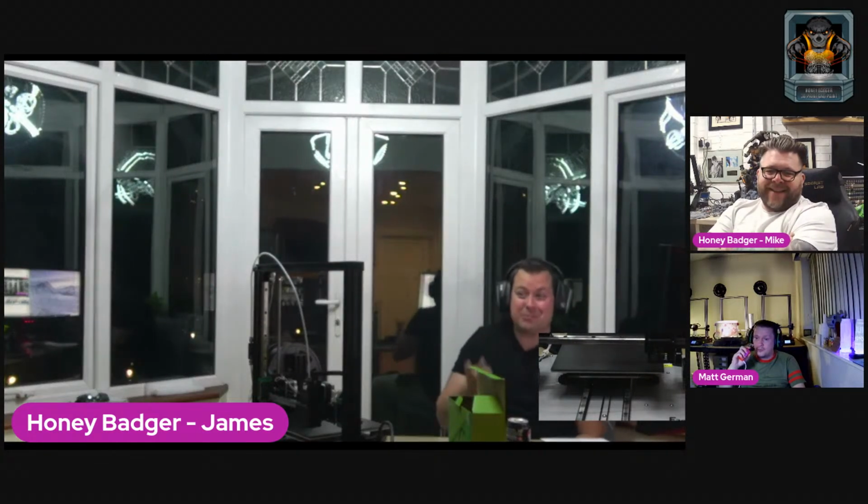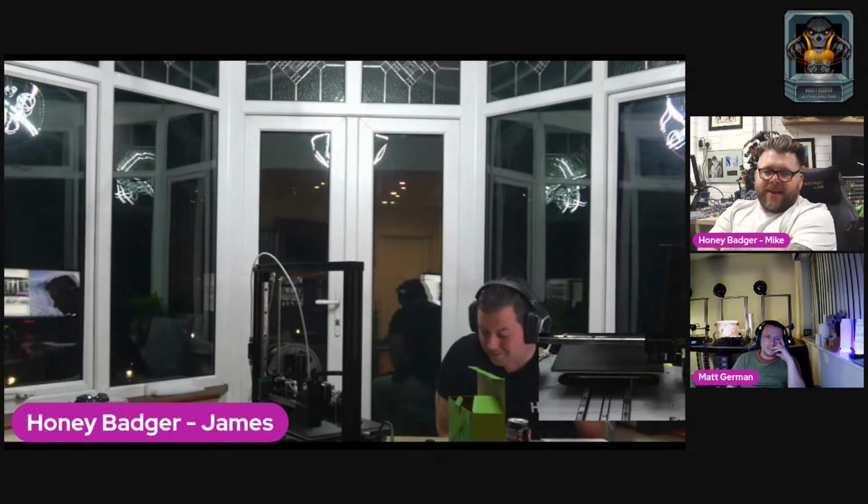After all the jokes, that's with a bent lead screw, admittedly without a working filament sensor. That has come out really nice. 100 millimeters a second cube. So we're clearly going to have to do a bit of testing. The only thing I would say is we've maybe a little lacking in cooling on one of the corners. It's a slight deformation. We might need to lower the temperature a little bit because that part cooling just isn't perfect.